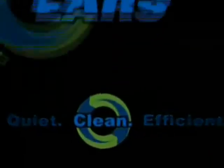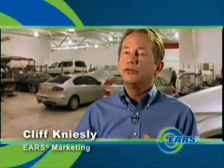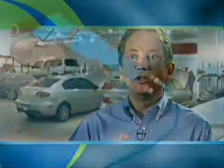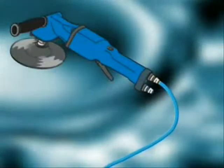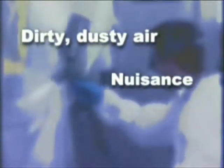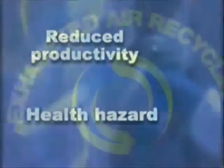Imagine those energy savings, and a cleaner shop too. The air compressor is drawing in huge volumes of air, and it will bring in molds, pollens, dust, chemicals, moisture. So what's coming out of that air tool is a toxic soup. In fact, in some countries, it's illegal to vent air tool exhaust within 5 meters of the operator, or roughly 15 feet. For techs who are breathing that dirty, dusty air, it's a nuisance that can turn into a health hazard over time, leading to sick days that cut into productivity.